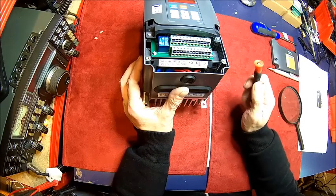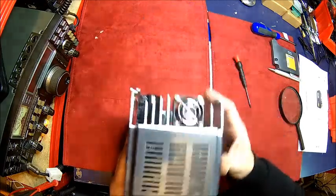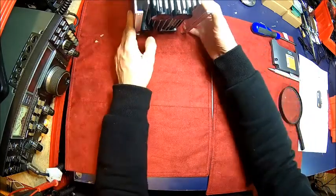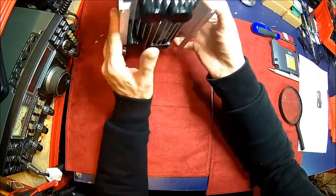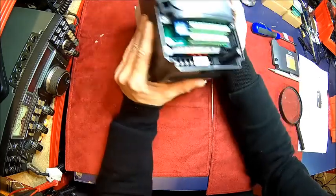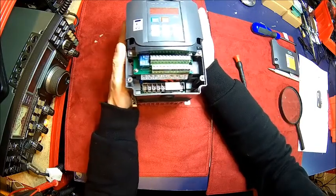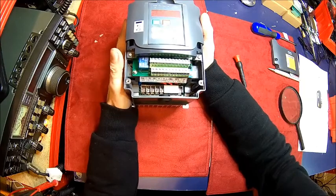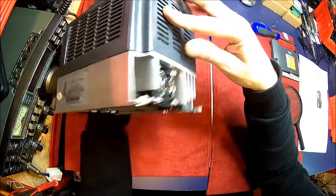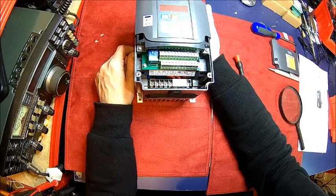What it doesn't have is access to the DC voltage, but you can easily get there. I would not run that thing without finger protection — if you stick your fingers in here you might get an electrical shock. It just doesn't feel good to run that without a case. What I also suggest with these things is it definitely needs a mains filter, because there is very little filtering inside — essentially nothing. This will jam your radio and your mobile phone eventually. It needs some serious EMC precautions — usually just put a decent mains filter in front of it and that should sort it out.